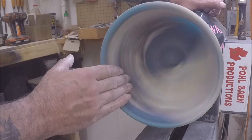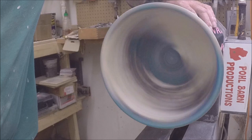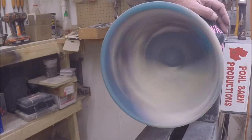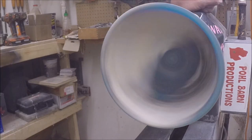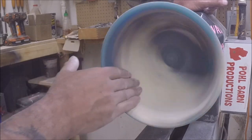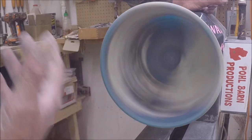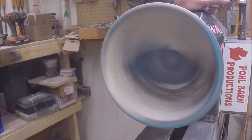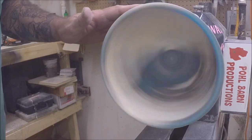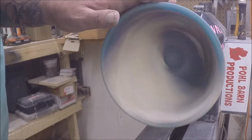So you hear that? So great, I'm gonna get this all sanded up. My video's a bit long, so I might skip through some of it. I'm not quite sure what I'm gonna do with this video. We'll get it finished. You know how I go, sand and sealer. After I sand through the grits, I've only done 120 right now. So I'll go down to about 320, seal it, hit it with the abrasive paste, the restoring polish, and probably the shine juice like I did the backside. But some of those cracks leak through on the backside, so I now have to finish that also. So, save you all from that.